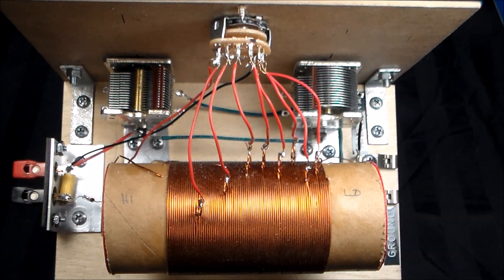But this is not really a band switch. It's just a rotary switch with nine positions to select different taps on a single 80-turn broadcast band coil. I built this set with the same care I take building a vacuum tube receiver. First is mechanical stability. Everything is firmly mounted to a half-inch plywood base. Nothing is temporary, nothing wiggles or can move. All leads are as short as possible, and all connections are properly soldered — no cold solder joints.